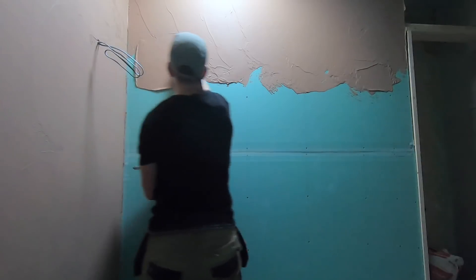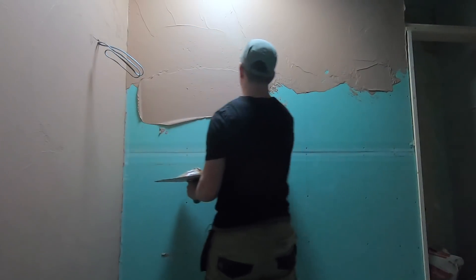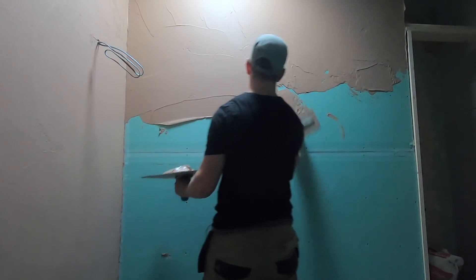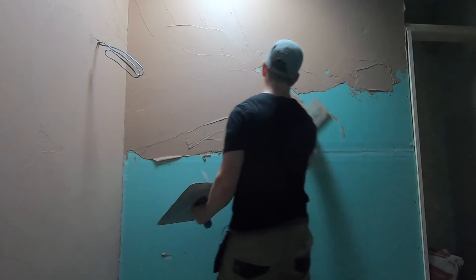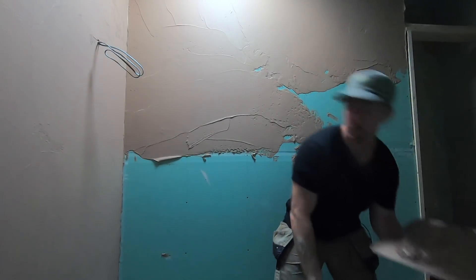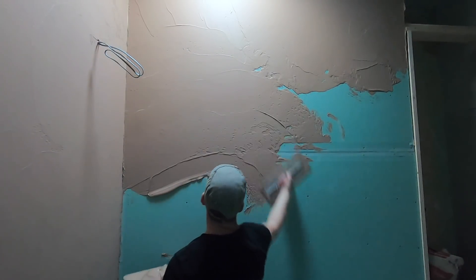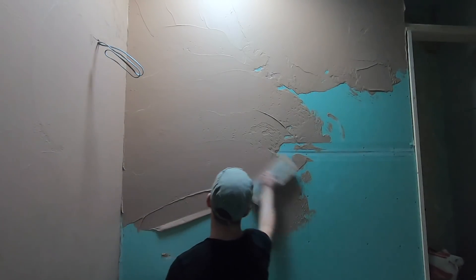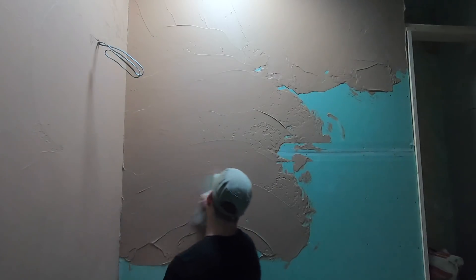What you're looking at here is a very small wall I'm plastering on, and this was mainly a trial because I've never actually done this properly before. It's actually for a bathroom and this wall is going to get tiled, so the owner just wanted it plastered anyway — I thought it'd be a good time to test it out. The main thing to consider if we are going to do one coat plastering is putting a bigger, thicker amount on at the beginning.